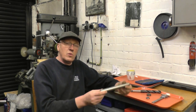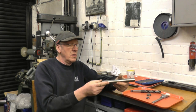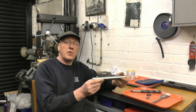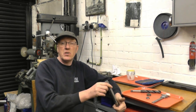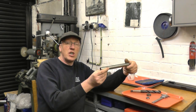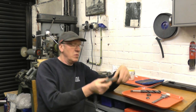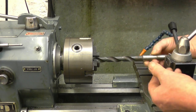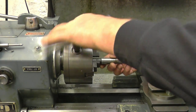The first thing we'll do is go across to the lathe, face this bit of bar on both ends, mount it in the chuck, and set the top slide over to cut the Morse taper. There are a few ways you could do it — you could offset the tailstock, or use a taper turning attachment which I haven't got. But I think on my particular lathe there's enough travel on the top slide to cut a number two Morse taper. So we'll go to the lathe and have a look.